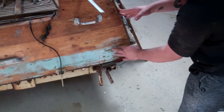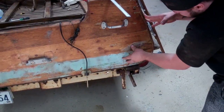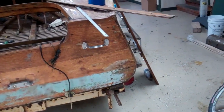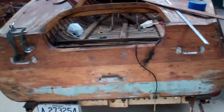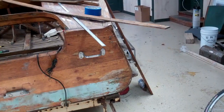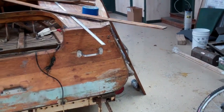It's got a little movement where it cracked right here. I don't think it's completely rotted, but since that's below the waterline and will be painted — there are actually three planks there — I think we're going to end up removing the bottom plank and replacing it. It sits in the water all the time, and it depends on the quality of the bottom paint to protect it.